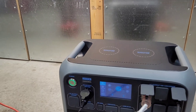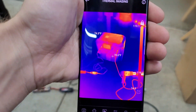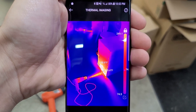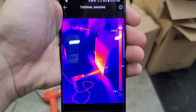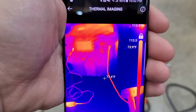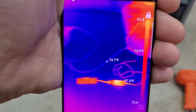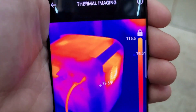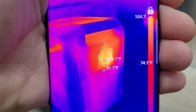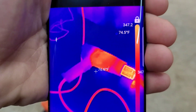It's been running for a few minutes with no issues. The cooling fans on the Bluetti are audible, so I took another look with the thermal camera. Everything looks all right — the cord is a little warm and the charger looks slightly warm, but the Bluetti itself doesn't look overly hot. Checking the fan side, we're seeing about 105 degrees again after a few minutes, with the fans running a little higher. Everything is doing fine.